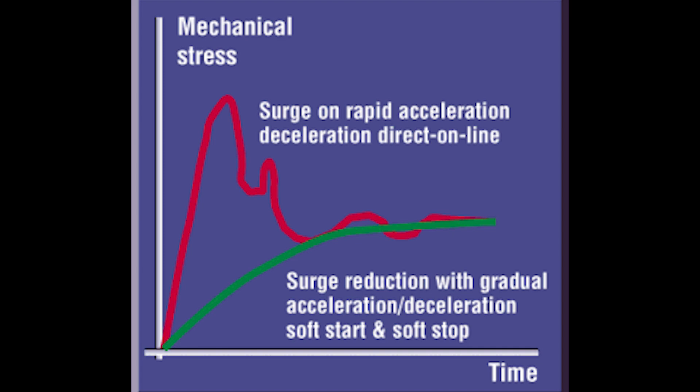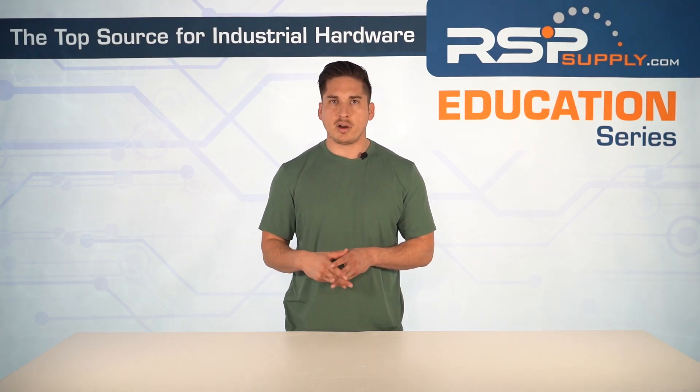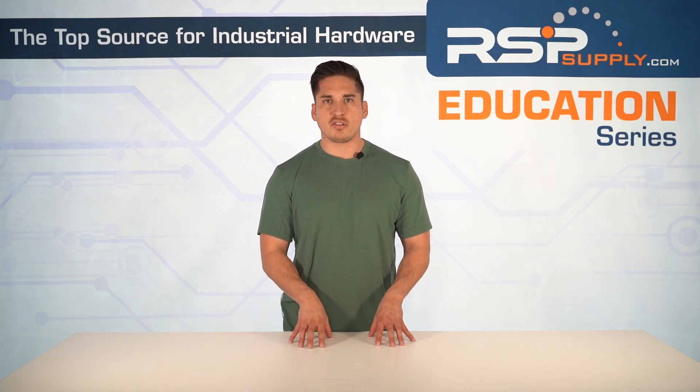In terms of motor and mechanical stress, the soft starter creates low motor stress and reduces mechanical stress on the motor and load due to its gradual voltage increase, while the standard starter causes high motor and mechanical stress, wearing down mechanical components. Cost is another differentiating factor. Soft starters come with a higher upfront price due to their advanced solid-state electronics and additional features like adjustable start/stop ramp times, current limiting, motor protection, and diagnostics. Standard starters have lower initial costs but can lead to higher maintenance costs from mechanical stress. Soft starters offer lower operational and maintenance costs due to consistent smooth motor operation.